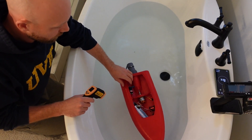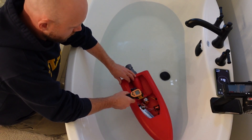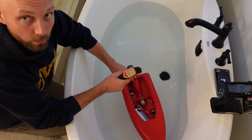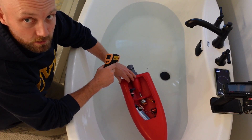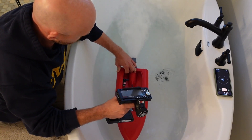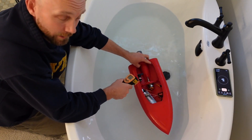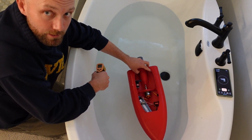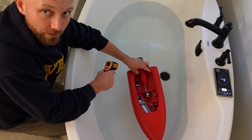We've got our D3542 back in there and I've been running it for about 2 minutes and 20 seconds. Unfortunately I didn't get it on video, but right now the motor is at just over 100 degrees, so it's doing pretty well. It's definitely far more powerful than any of the other motors I've tried and I'm really happy with the performance. I'll give it another 30 seconds and see how hot we can get it. The temperature has actually gone down — we're only at 100 right now. I think we can safely say this one is going to work with a ton of load, and I can also put a 4S lipo in if I want to go faster. Though I have a feeling 3S is going to be about the max before it starts cavitating too much.